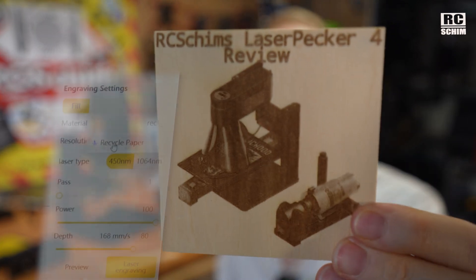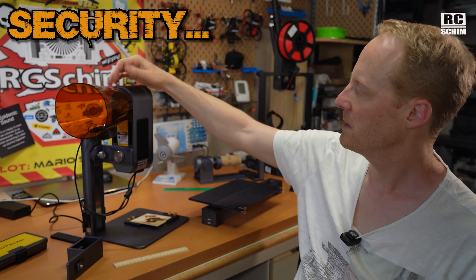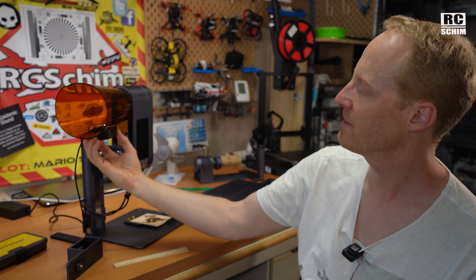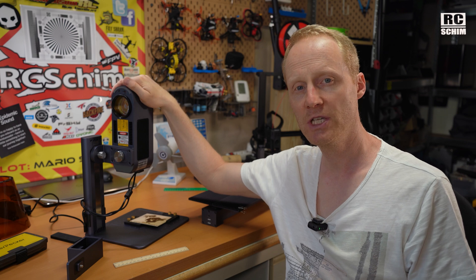In the software you have preset materials that give you an idea. For this example I used a sheet of poplar plywood — the preset settings looked fine. For other materials I did some experimenting and I'll put the results in the description. The fan for fume extraction is magnetically mounted, but you're always touching the object and may move it. The fumes happen right where it's engraved and are blown out into your room. You need a hose connected to a window or outlet.